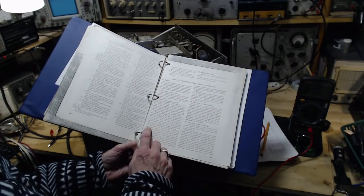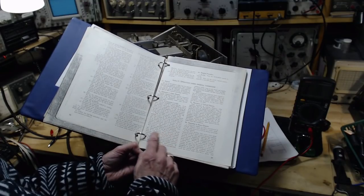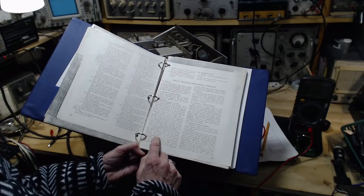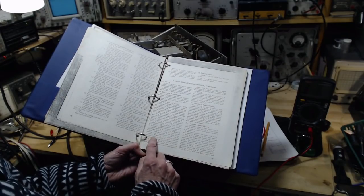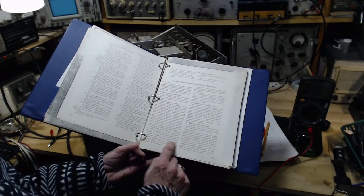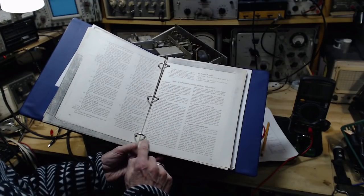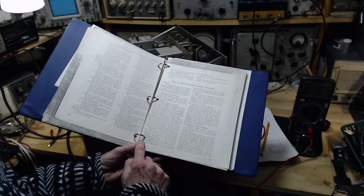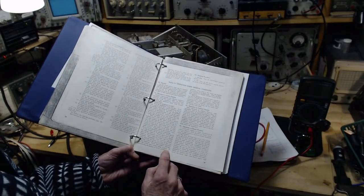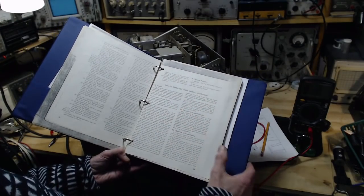The headset has rubber earpieces. When operating in open air with headsets, do not have the rubber earpieces. Wear a knitted woolen cap over the earphones. Frequently, when the headsets without rubber earpieces are worn, the edges of the ears freeze without the operator being conscious of this condition. Never flex rubber ear caps, since this action may render them useless. If water gets into the headset receivers or if moisture condenses within them, it may freeze and impede the action of the diaphragm.